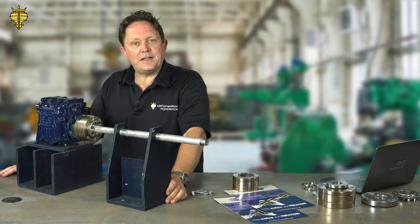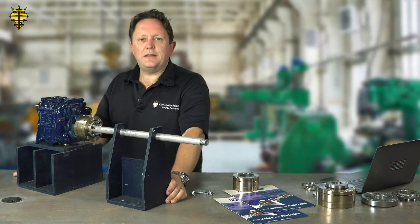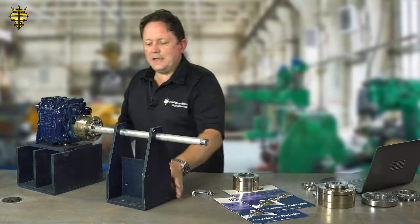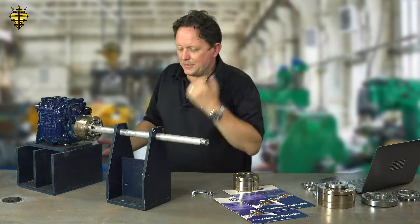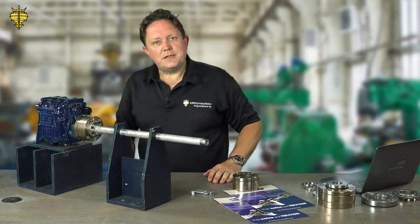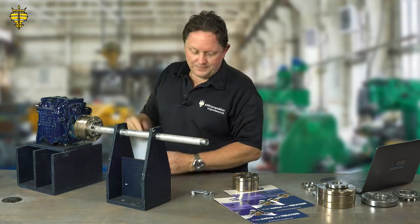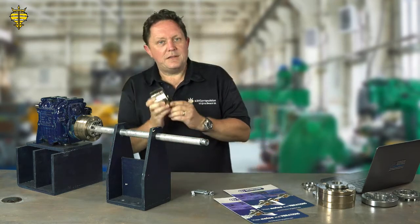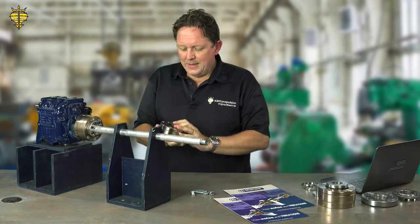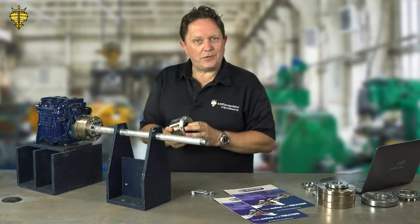The alignment will then affect your on-board comfort. It can affect the seals, it can affect so many things on the boat. So it's really important to pay attention to all this — understanding the sensitivity of this system, which is what the e-book goes into. This is not a constant velocity coupler. I would say it's more like a ball joint that can take a thrust load.